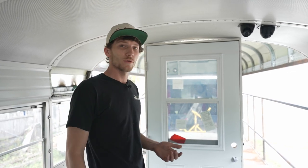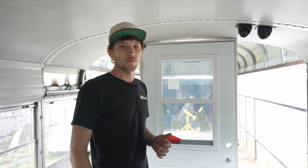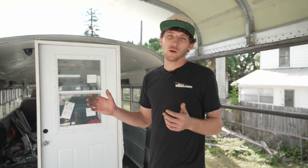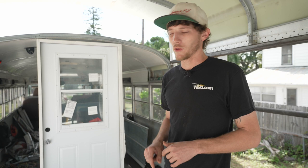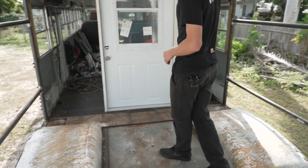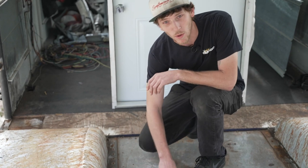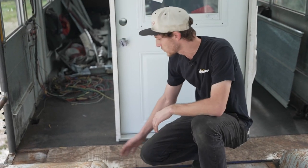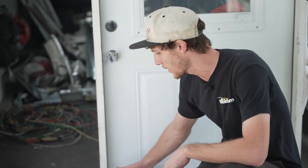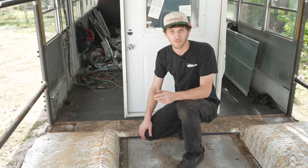Before then, I'm going to take you through some of the things I encountered when cutting the floor, the sides, and raising the roof, and we're going to weld out some hand rails. On this project, I knew we were going to want to raise the roof, but first we had to start down below with the flooring. This flooring is actually just nailed to the sheet metal that's spot welded to the frame rails underneath. I started by cutting back the rubber mat and then prying up all the plywood flooring. I then cut any of the screws and nails that were left protruding through there.